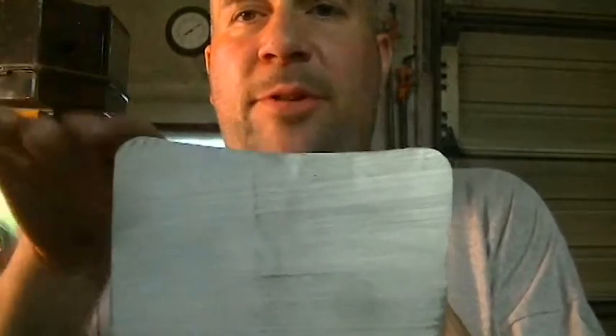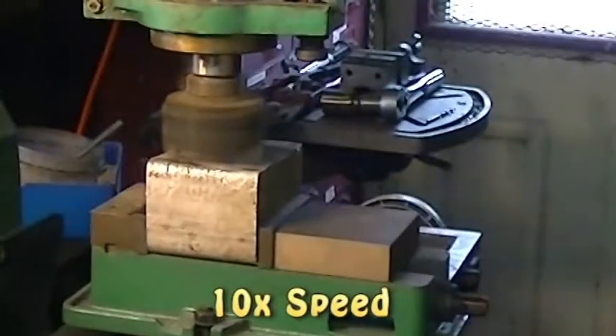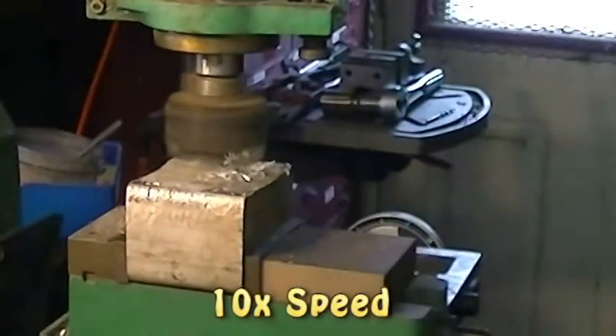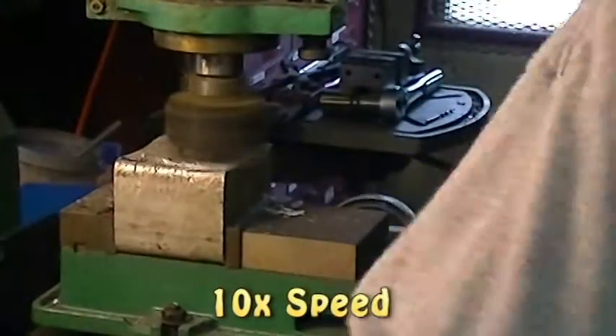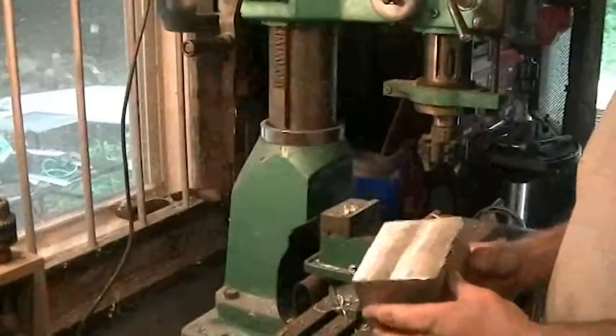That's why I don't drink beer — it goes way too fast. The band saw is done chewing on the aluminum. As you can see, it's not a bad cut, it's pretty flat. But if you look at the cross section you can see a dip in the top of the billet. So what I'm going to do is flatten that first in the mill — that's going to be my first operation. After a couple of passes, it's nice and flat.